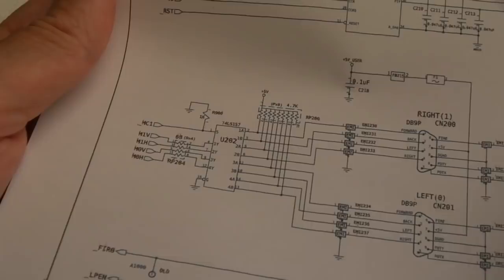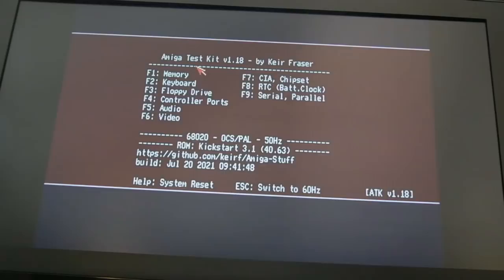I think I'm just going to get a toothbrush and have a clean around that, see if that improves the situation. I obviously cleaned around there, and it's much worse. I can hardly move the mouse at all now. So, yeah, it's deteriorated, just from a bit of vinegar. And I made sure it's dry. I also re-soldered the solder points on the first port nearest the battery. Didn't make any difference at all.